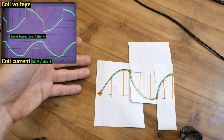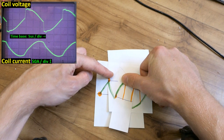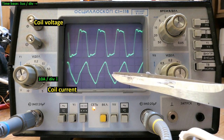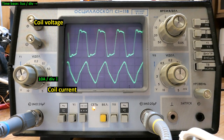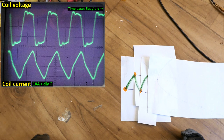This is at full power. When running at low power it runs even more above resonance, so it shrinks even more and will look more like a sawtooth or triangle wave. At power level 4.5 the voltage on the coil is very similar to a square wave, and the current waveform is similar to a sawtooth or triangle wave. Running significantly above resonance means the resonant circuit is mostly inductive — the capacitive component is almost negligible, the capacitor bank has almost no high frequency voltage on it and is working as just a voltage divider. Because it's not resonating with the capacitors, the coil is mostly getting the voltage from the half bridge, very close to a square wave, and the inductance is integrating that square wave into a triangle wave. The current waveform is actually not far from what my paper waveform simulator shows.